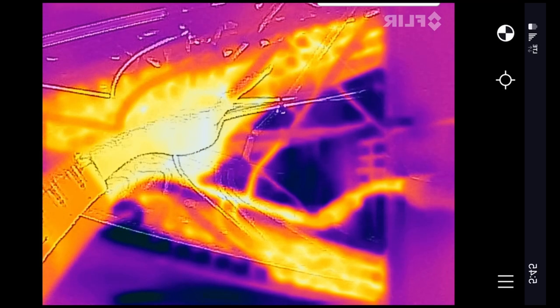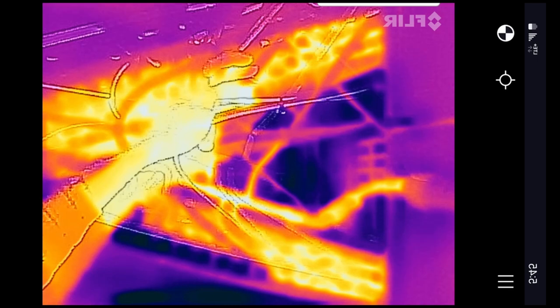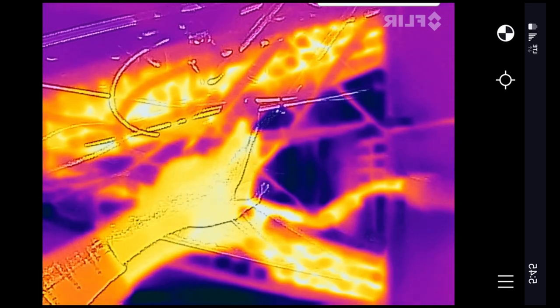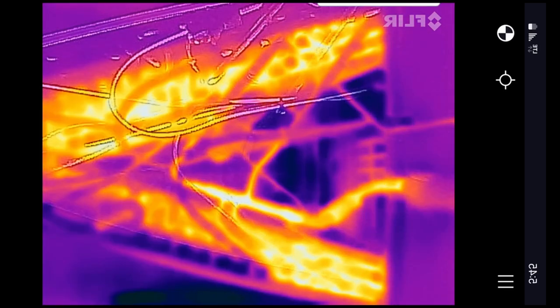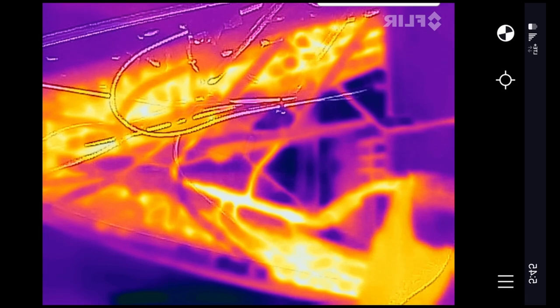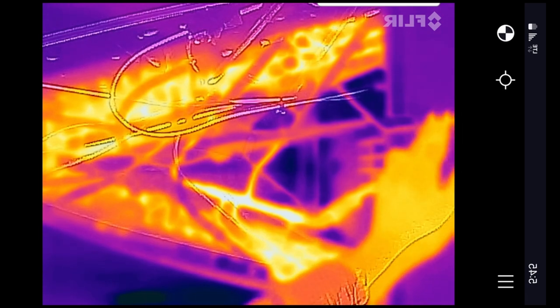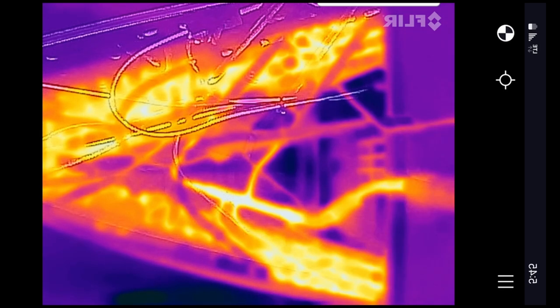This electronic expansion valve is going to open up all the way and allow the refrigerant to bypass. Refrigerant's going to bypass through that EEV, and it's going to travel all the way through the liquid line, all the way back outside. Here you can see where this line is really, really hot because this is our discharge line. And this line is warm, but it's our sub-cooled liquid line. It's sending liquid back outside to the outdoor metering device.